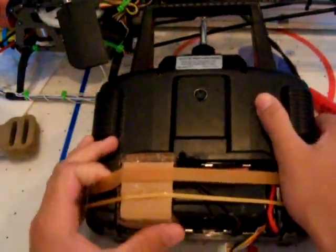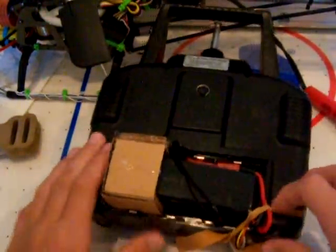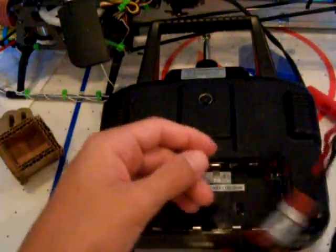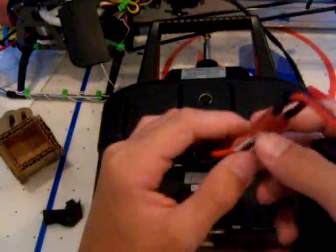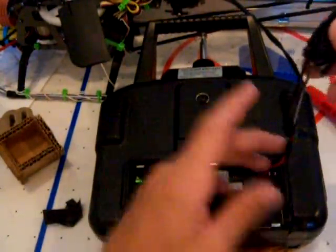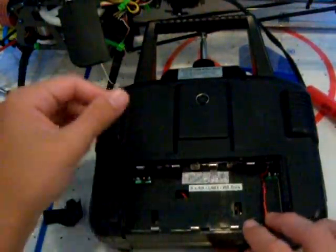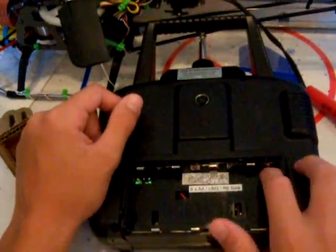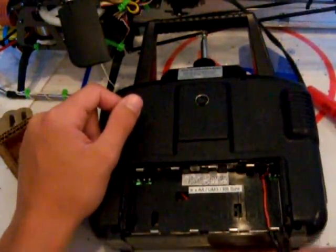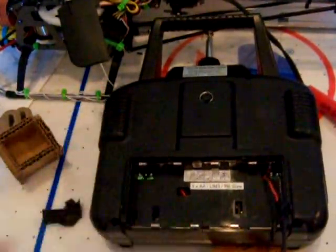This is what the back of mine looked like. I'm not finished designing it, but I only did it mostly to see if it would work so I could do it on some of my better transmitters. Here's the battery I was using. I soldered on a Dean's Connector — it's a little messy because I didn't have any shrink wrap. I've got the Dean's Connector, the male plug, and I wired it to the red and black wire, the red on this side and the black over here. That gives me a negative and positive power on the Dean's Connector, and I can connect it to my battery and just run it on a LiPo.